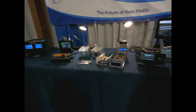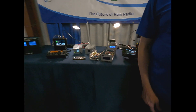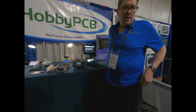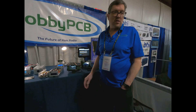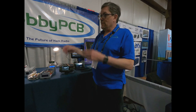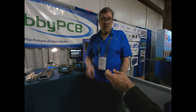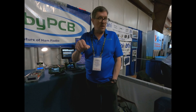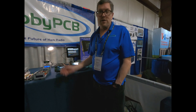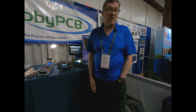They're all HF, 160 to 6 meters. The 500-watt only goes to 10 meters. We don't recommend the 500-watt for use with 100-watt radios because even if you turn the power down, they use ALC and it puts out power spikes — or you hit the wrong button, and 100 watts into that amplifier will fry it. It uses ALC to regulate power, so sometimes the first hit puts out a lot and then cuts back.